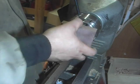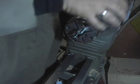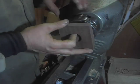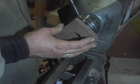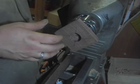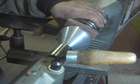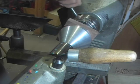I'm going to change my chucks out. I'm going to put my G3 chuck on, put my insert in there, and get this kind of lined up. That's gripping it fairly tight, though it's a little bit loose yet. And I'm going to do the same trick with the live center, the tailstock, and the cone. Right now it's not really that square. Put that on there, give it a little push, and then I'm going to loosen this just slightly, give it a little push, and then tighten it up.